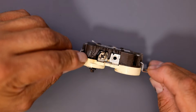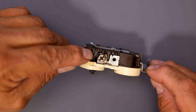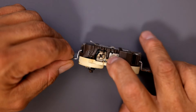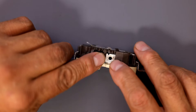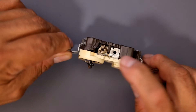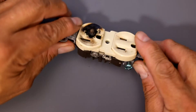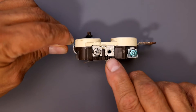When I pulled the wires out I didn't see any arcing on any of the nuts. The other one had no indication of arcing on the wire, the nut, or the device. So this just happened from overheating on that side. Same thing on the other side — no indication that the neutral, the larger side, was arcing at all.